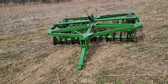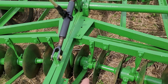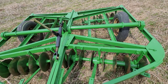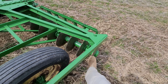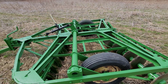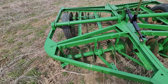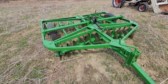In today's video we're going to get these greenies going — these unknowns. The plan is to get some grease in the zerks and see what happens. Can I blow the dirt and old grease out, or do I have to eventually take them apart? I've got them up off the ground. No grease in them, but I think with grease they'll all turn. They just need to move. If I can, with any luck, I'll be able to blow the dirt and old grease right out. I can also throw a little heat on there. Let's get hooked up and get some grease in those zerks.